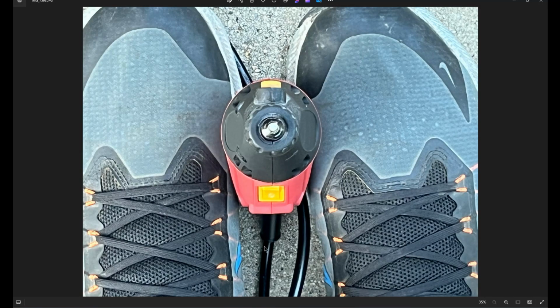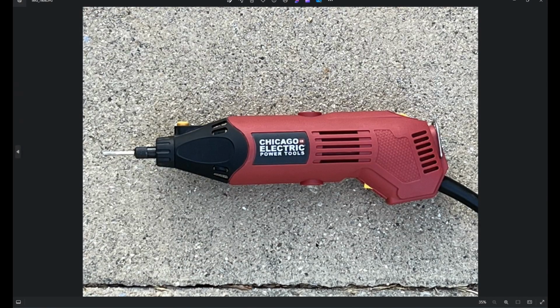Here is the one picture here. As you can see, it's kind of like an oval shape. I take it down here near my feet and zoomed in because I'm trying to get it as close to 70 millimeters in the zoom, because that's closer to orthographic and you won't get any sort of distortion or warping from perspective. And here's the second image here.